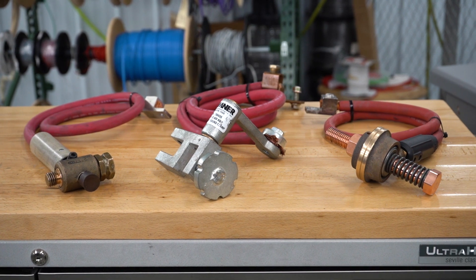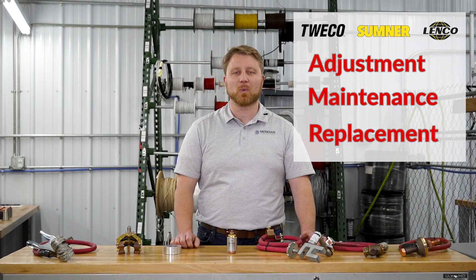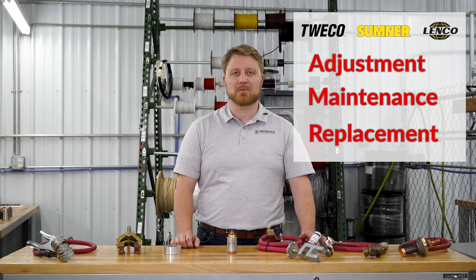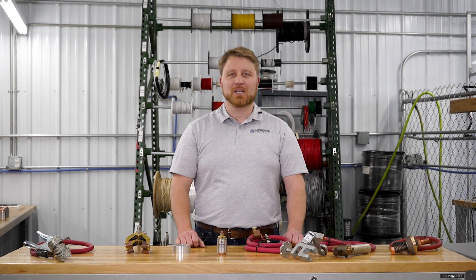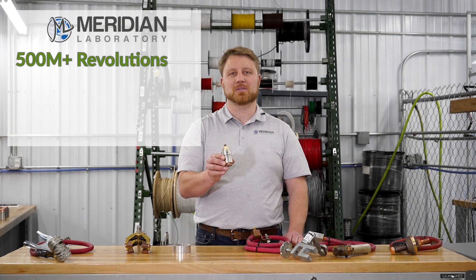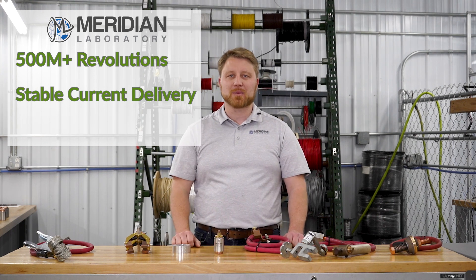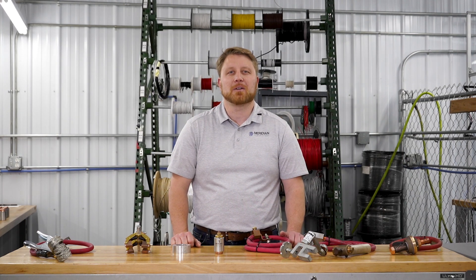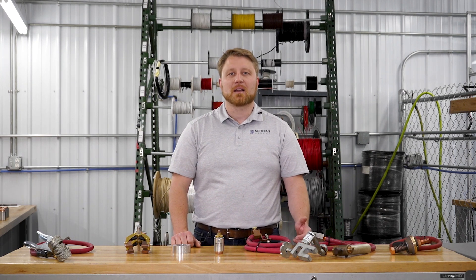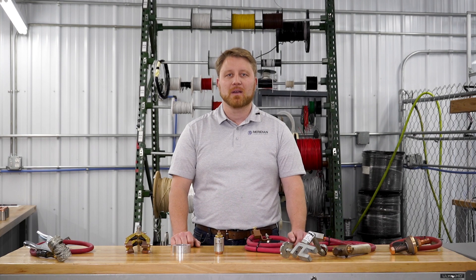Keep in mind, the Twico, Sumner, and Lenco offerings all require varying degrees of adjustment, user maintenance, and eventual replacement because of the basic nature of the metal-on-metal wear used to transfer current between the stationary and rotating parts. Overall, the Rotocon ERG400 provides the most consistent and uninterrupted current delivery. Rotocon ERG rotary grounds have been tested to half a billion revolutions without showing change in electrical resistance and deliver current consistently without any fluctuation. It is a 100% sealed and maintenance-free solution, making it ideal for high-volume, high-duty cycle, or high-value applications in which downtime and maintenance is costly, difficult to perform, or oftentimes just forgotten about. With consistent current and reliability comes better welds or more consistent plating, and overall more consistent process control, which translates into less scrap and a higher quality end product, ultimately saving time and money.